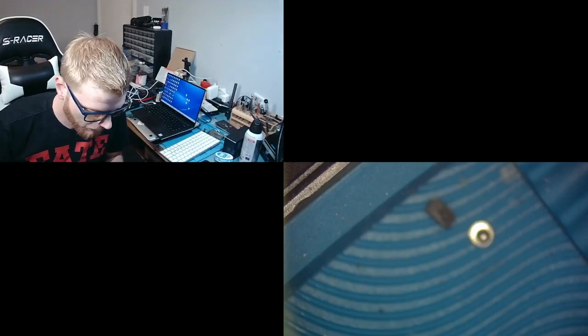Now that it's been a few minutes, I'm going to tilt this down so you can see how I'm doing this. From the bottom of the board, I'm going to pick it up like a spatula, then put it over here and gently set it down. I do that so it cools much faster, because this board heater is still burning hot and would keep the board hot. So after a few minutes, I do the spatula trick, take the board off the board heater and move it to the side, and that will definitely speed up the process in which this board cools.